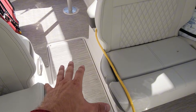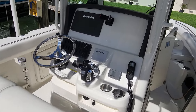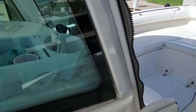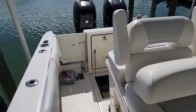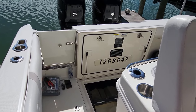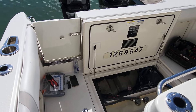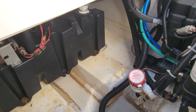All our snaps are in, it's good and tight. Now we're hopping across the street to a Boston Whaler. We've made it — this is a 280 Whaler, it's actually 10 years old but in very nice condition. The customer definitely takes care of it — even the cushions look good. We are working on the toilet system here. The vacuum flush system has a failed pump. I don't think I'll be able to film getting in that hole, but I at least want to show you how the system works — it's basically the same system on brand new boats.